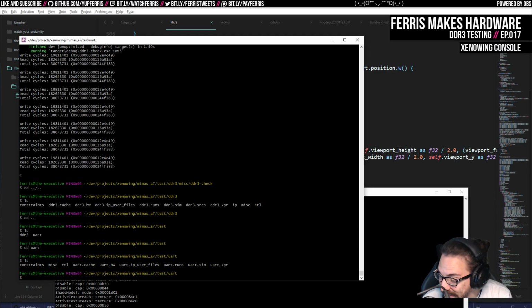And we're still going to be hit by latency in any case, because the way this tiled renderer works, it's going to issue some commands to the tile renderer, and then it's going to wait until it's done. So it's like this closed loop, and we're going to get hit by that latency quite often. But it might be also that I could put 3 or 4 of these cores in there to mitigate that, at least for testing. So who knows?